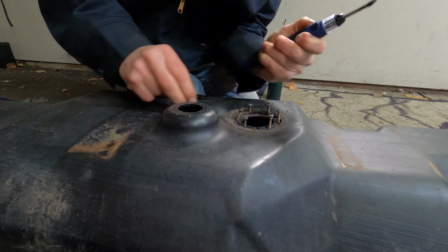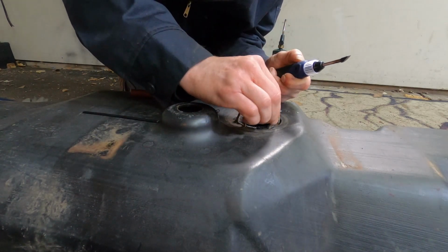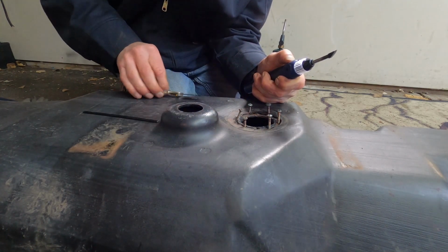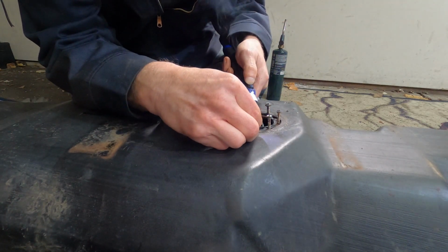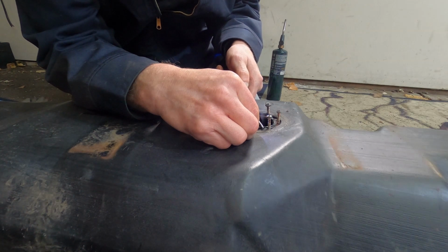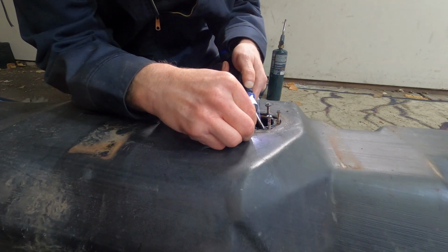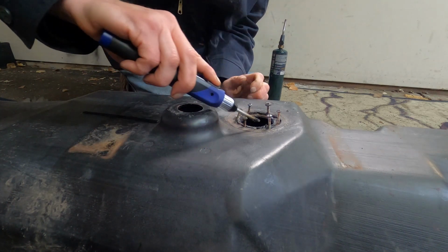So the thing with this plastic, this polypropylene, is you can't fix it with anything other than polypropylene. None of it will stick over time. I'm just going to use this old piece here and see if I can reuse it. In time, it will give out because it just won't bond. Once you melt it in with the other stuff, then it just becomes one piece again.